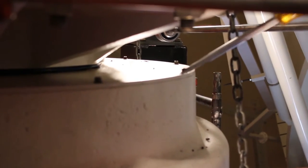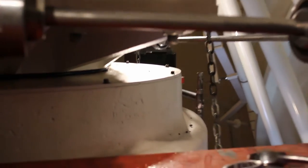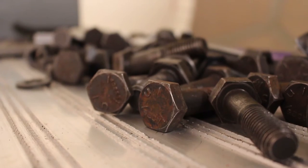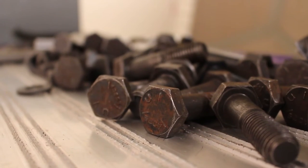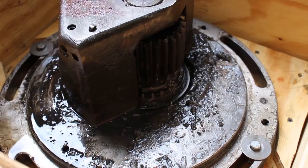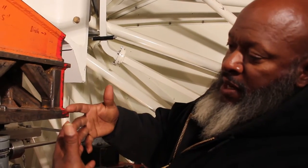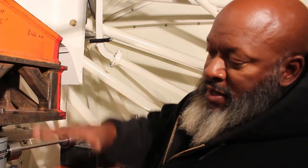Once we get it out to this deck, we'll lower it to the ground, take the other bearing up, feed it in, set it down, torque it, bolt it, safety wire it, and engage it with the gearbox — because the gearbox is what's going to drive that gear. Then we'll set the backlash, fill it up with oil, and set it down.